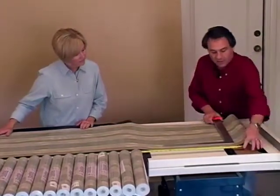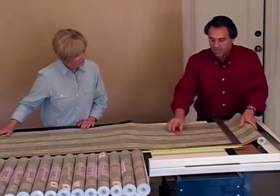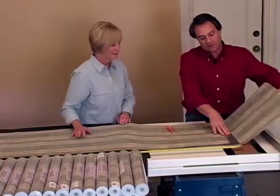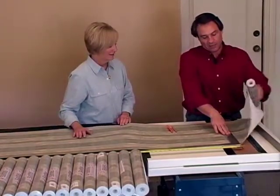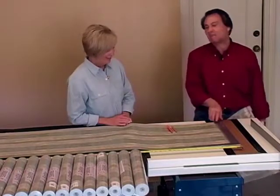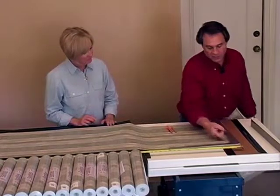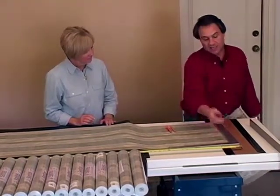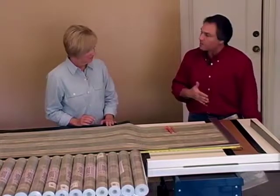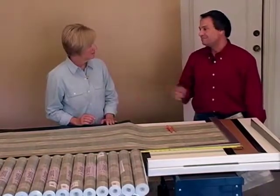You can see I've measured out 9 feet over here, and I'm going to line up this carpenter square, and I'm going to show you a little wizard trick. I learned this many years ago. My grandfather taught me. You take this, and you pull back, and it cuts the paper. It's a paper cutter, too. So automatically now we have our 2 inches, because we already built in the 2 inches. We know we now have our master sheet, and all the sheets are going to match after that.